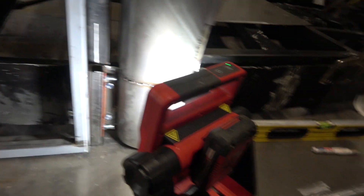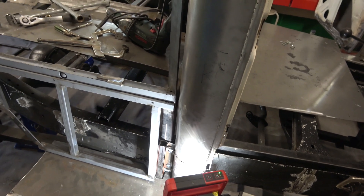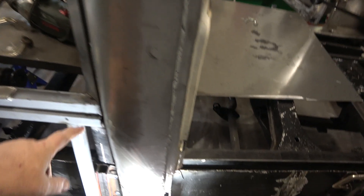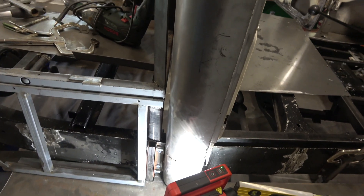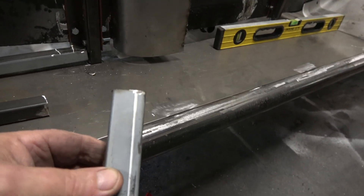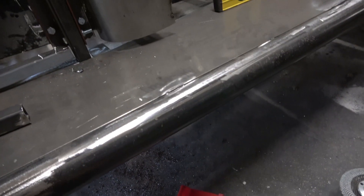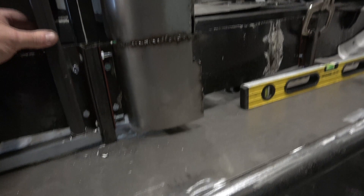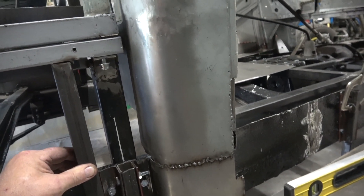So what I'm going to have to do now is notch this out — I've got no choice because it's in the right position now. It's something to look out for, this kind of knock-on effect. We put this bar in first and I had to bring this across — if I'd brought it across just 4 or 5mm more I wouldn't have this problem. What I've decided to do is, rather than cut all that piece all the way up and make a notch in it and weld it all back, I've just built a new leg and I'll just bring the leg back there. So it's right in line with that. The distance is 3.5cm — it's not a massive deal and I can use the rest to screw the side plate in, and that'll save a lot of work.